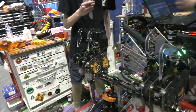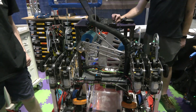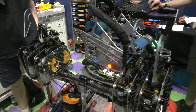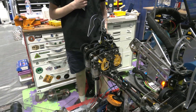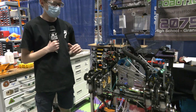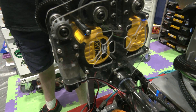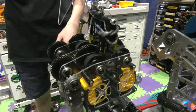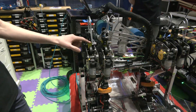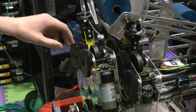Let's wrap up the robot — handing it off to Quinn to talk about the climbing mechanism. I see tape measures and individual motors for each part. I don't think I've seen a team with four independently articulating parts for their climber. What were some other concepts before you landed on this? A couple of other designs we considered were a bendable Lexan climber and regular telescoping tubes. The concept here is very similar to telescoping tubes — we just use tape measures to deploy the hooks instead. There are a few different moving axes, with compliant wheels that drive the tape measures out, and each module can rotate.